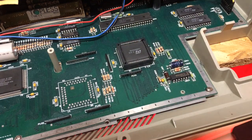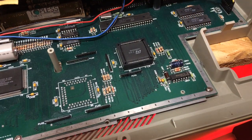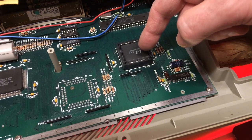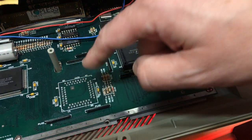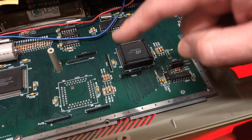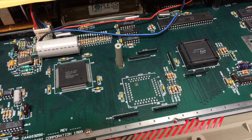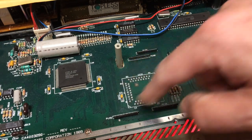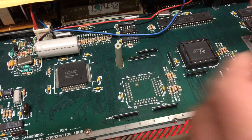Sure, I can pull the actual processor out with a pair of PLCC removers, but how do I get my board to fit in that processor gap? Now, I could desolder the entire thing and we'd end up with a footprint like this. This is, I believe, the old footprint for the Blitter chip prior to its functionality being integrated in this combined glue and Blitter ASIC over here, and I'd end up with a footprint that looks, you know, broadly similar to that, and then I could sort of build up a platform and then maybe an adapter and things like this. So